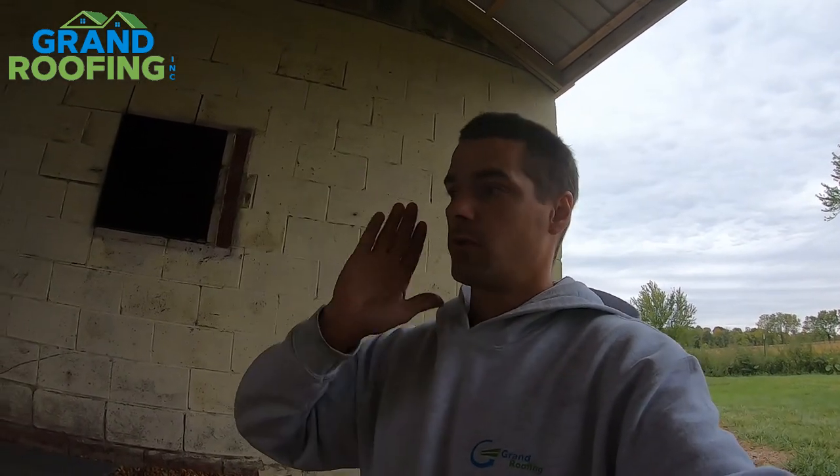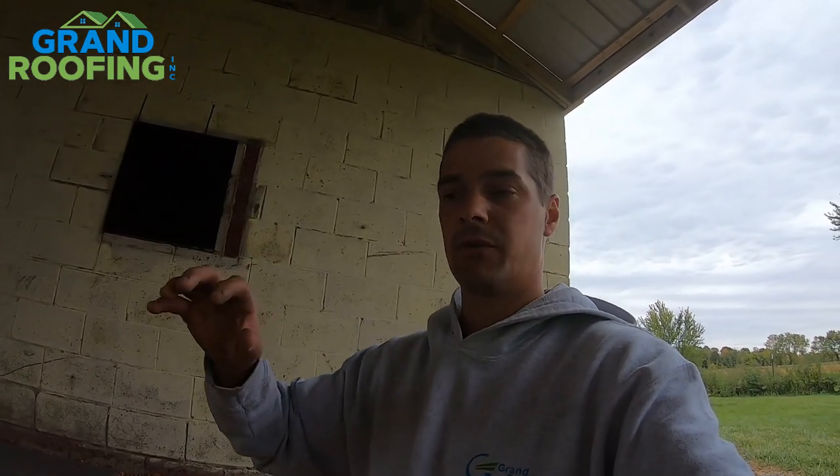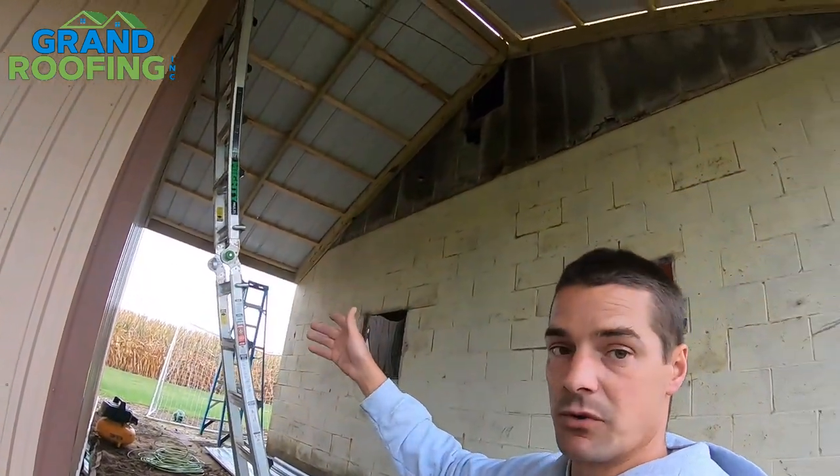My overall opinion: it's very affordable at around $55–60 and totally worth its cost. It will save you on long straight cuts and save your arm. Unfortunately for cutting valleys, angles, and radiuses it's not going to work well. It will rip through ridges if you can flex the panel — don't do it on a visible bottom side, only near the top ridge where the ridge cap will hide it.